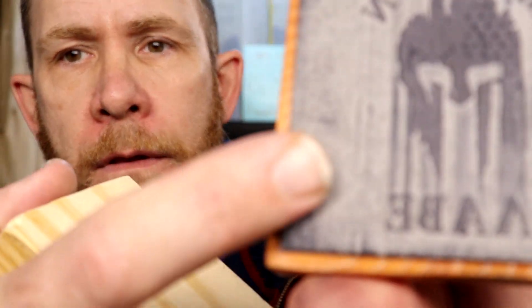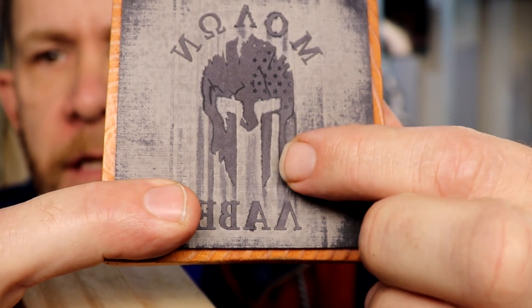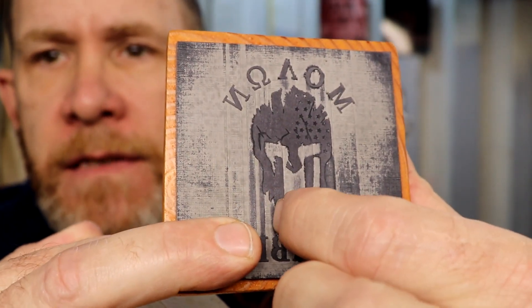What I did to get rid of those extra lines was turn off fast white space scan. When I had fast white space scan enabled, that's what was causing all those extra lines that shouldn't be there on the helmet. I turned that off and got exactly what I wanted, with the depth I needed at the speed and power on the 10-watt. Thanks for watching — please hit that subscribe button, hit that like button, and we'll see you in the next video. Have a great day!